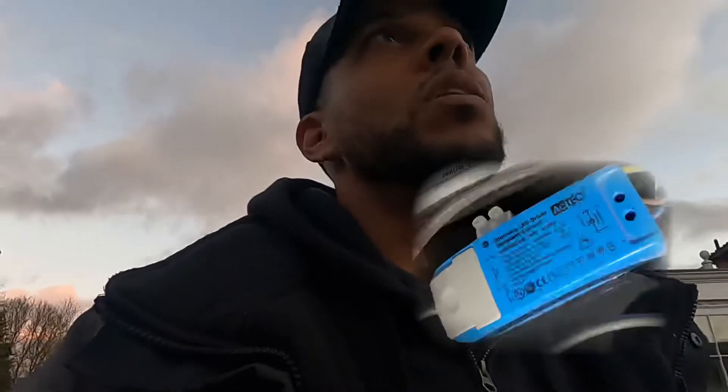They're not flickering today, but last time they were all flickering. There are 11 of them in total — that's 33 watts — and they're currently being driven off an 18 watt driver. So I'm not sure if they've wired them in series in a couple of banks and then paralleled those banks up, effectively splitting the load to run on a lower wattage driver. We're going to find out.